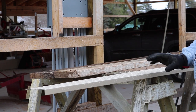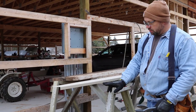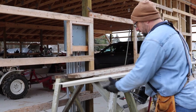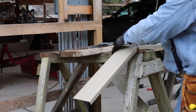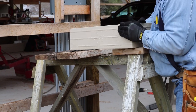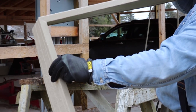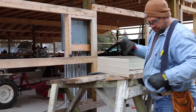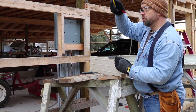So this piece of fascia is going to be mostly along the front, the eave end. But then I'm going to notch out these two 45s to fold this over to cover the end. Like so. So the 45s that I notched, when I bring this together, form a nice clean joint. I want to cut a 45 on the bottom edge of the soffit on the end to match the 45 I put there.